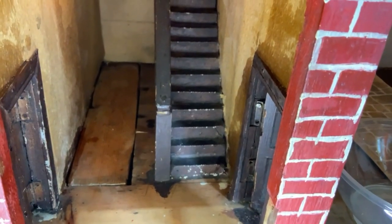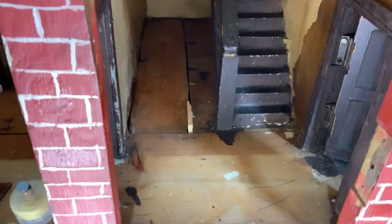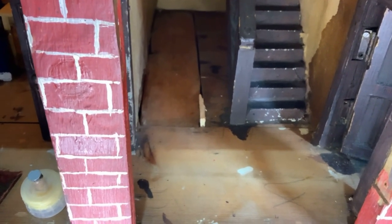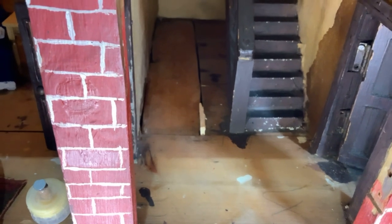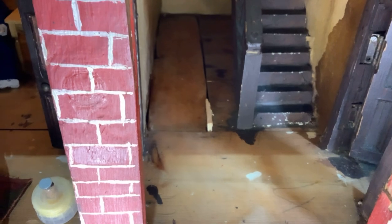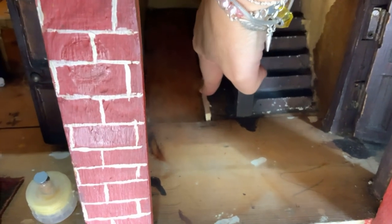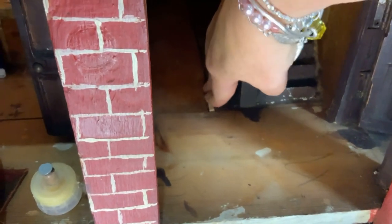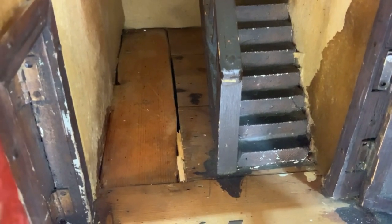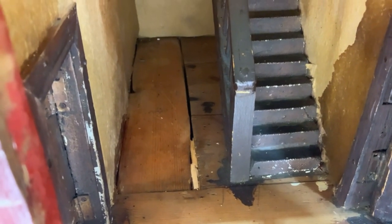I need to see if I can fix that floorboard in place, so I'm going to find a bit of wood. I've got a piece - just a rough piece of pine. It has a relative age to it, it just looks new because it's the middle of the old pine. I've scored it and broken it off because I wanted it to go to a wedge shape at the end so it would be tight. It's smothered in wood glue and I'm just going to push it in. It's a bit loose on this side but tight there - you can see the glue squeezing out. That piece of wood is not going to go anywhere now, and let's face it, they're not very heavy - not going to put a foot through the floor.